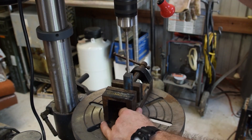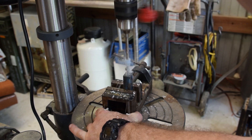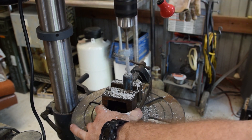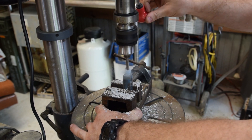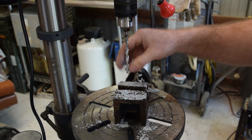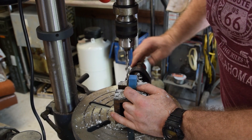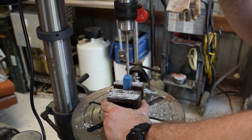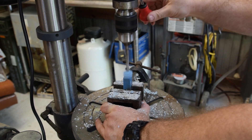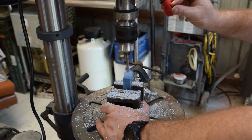Next we have to drill them out. This is a seven millimeter drill bit sized perfectly for the brass tubes we're going to be gluing into the blanks. I put it in a vise just to hold it steady — it drills very easily, just like wood. Make sure it's square; that's the most important thing because you want the hole straight through the blank. That'll help out when turning later. We're going to drill both blanks all the way through.